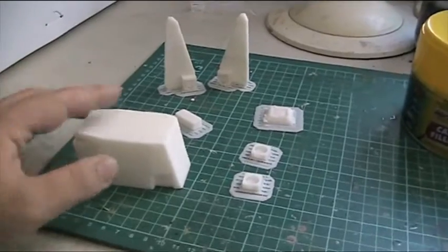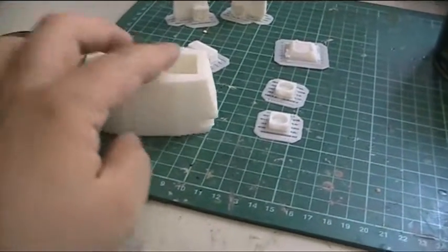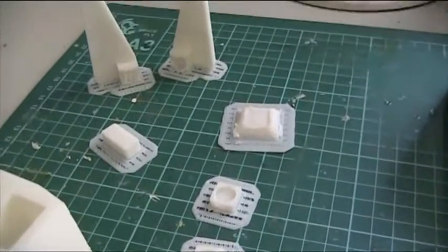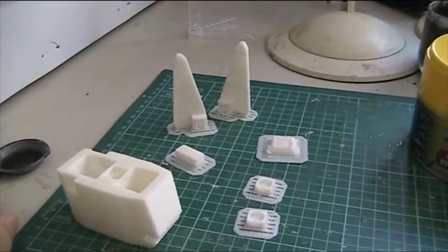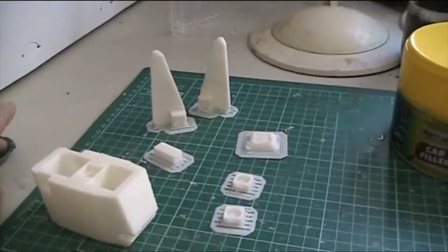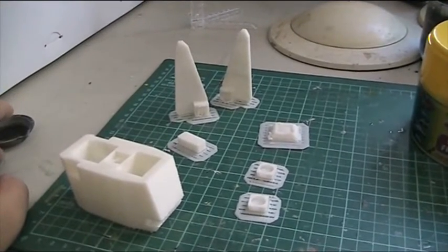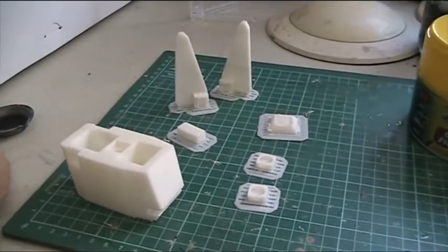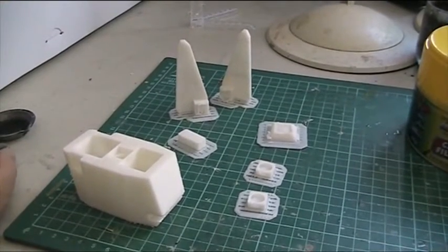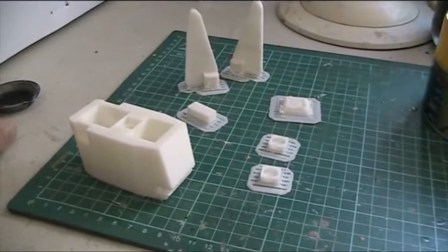So I have done a total of 10 prints on the Buildtack. Some of them are quite complex for a tricky project that I am doing — printed upside down with rafts in ABS PC at very high temperature. I am quite happy with the quality. There were a couple of fails, which was my fault due to the settings and the reel getting jammed. In the way of sticking to the surface it was absolutely perfect. After the first couple of prints, everything was very easy to remove with the spatula. A friend of mine is also using one on a larger 1x1 foot print bed. He said once the model came off and the raft stayed back, he had a lot of trouble taking the raft off. Once you get the first two rafts off — which is very, very hard — just go hard at it with the spatula and don't worry about damaging it, then it is pretty much smooth sailing from there.